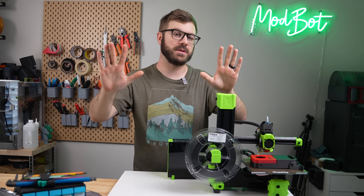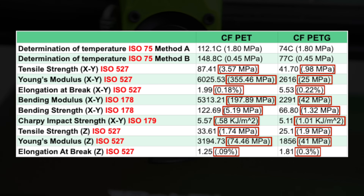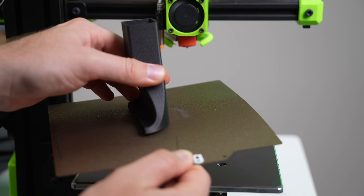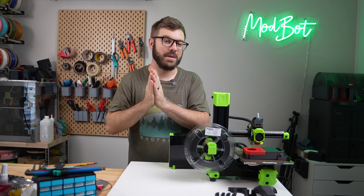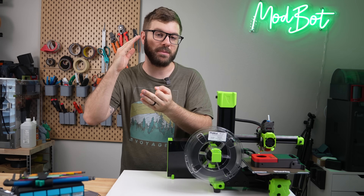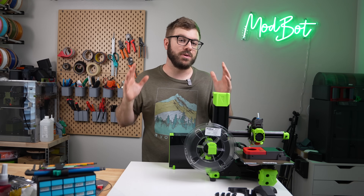For mechanical properties, since the two tables on the FATIS product pages aren't in the same order, I took all of the data and put them into a simple, comparable table. The PET carbon fiber has much higher tensile strength and bending strength than the PETG carbon fiber, but the PETG carbon fiber has about twice as much impact strength and higher elongation at break. In summary, PET carbon fiber is the better material if you need higher temperature resistance and a stiff, strong part. If you need a part with more flex and better impact resistance, then PETG carbon fiber is the better route. It all comes down to your unique application.